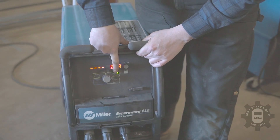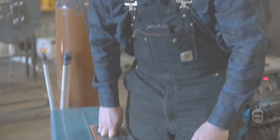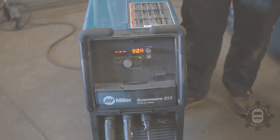From there you just set your amperage. For this thinner stuff I'd probably start somewhere around 90 amps and see how it burns, because a lot of the control in TIG is with your hand and your foot — you have control with the pedal as well. This is why TIG is a lot more complicated and harder to get good at: you need both hands going and your foot at the same time. With MIG, control is mostly in the machine settings; with TIG, the control is on the operator side, which is why there are fewer people TIG welding than MIG welding.